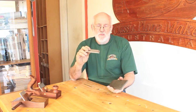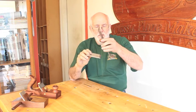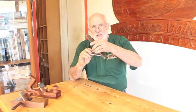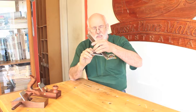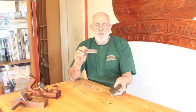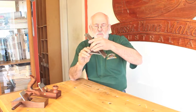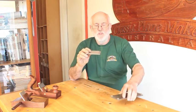Now, this is a very sharp 30-degree blade, right? If I take a sharpening stone and put that at 50 degrees, and put a bevel on there, I'm taking away some of that sharp, usable edge of the 30-degree bevel. If that's not quite clear, take it to the extreme: keep coming up with my bevel and put a 90-degree bevel on that blade, and essentially that blade is blunt.